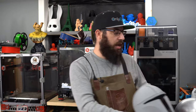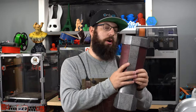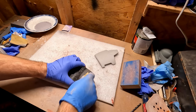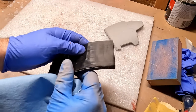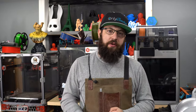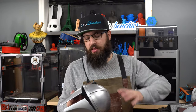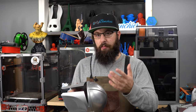Other materials, such as ABS — which is the plastic I used for my Mandalorian armor — or ASA, you can actually go right into sanding right away. It takes to a sander very well. When you're doing some of the bigger pieces like the chest piece, you can even use a palm sander. I used a Black and Decker mouse to really knock down those layer lines very quickly and speed up post-processing time. Regardless of which plastic you pick, you are gonna have to do some post-processing to clean it up.